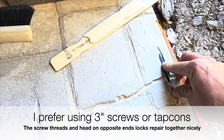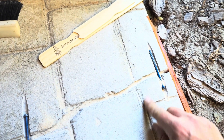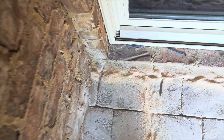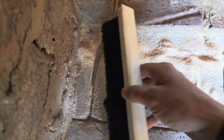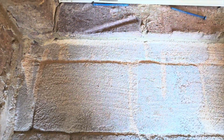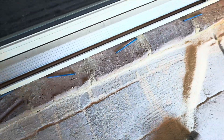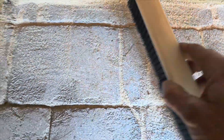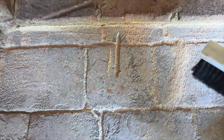One main thing is you want to make sure that you're flush across everywhere - you may have to either cut deeper or turn it. See that right there - fits good. What I do is take dry sand - you do not want to use wet sand - and basically just sprinkle some out with my hand and then run this brush down through here all the way down, then go back over it to make sure we're down roughly a quarter inch or so.